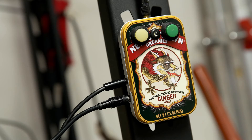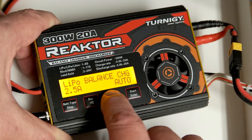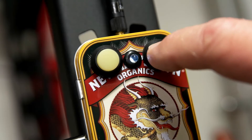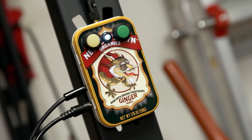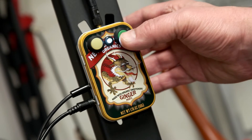When the emailer is first run, the LED slowly flashes five times to indicate the script is loaded. After that, the LED remains off until the start/reset button has been pressed. Start/reset can't be pressed until the charger has started a cycle, because most LiPo chargers beep with each key press — something that would be seen as an event and cause a false trigger. After a cycle has started — balance, fast charge, discharge, etc. — it's time to press the start/reset button. The LED will then blink once every two seconds as a heartbeat to show the script is actively awaiting an event. When an event is detected, the LED momentarily goes on and then flashes rapidly to indicate an email is being sent. Once the email is sent, the LED remains on continuously until the start/reset button is pressed again.